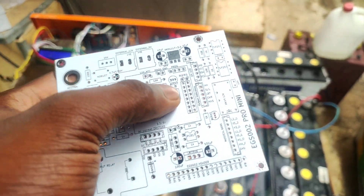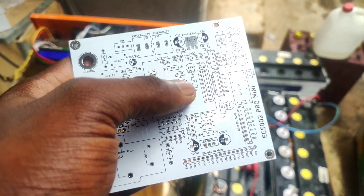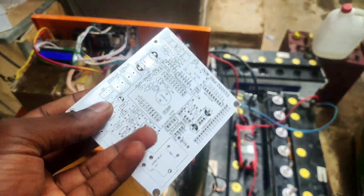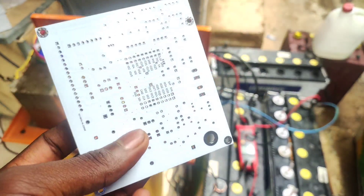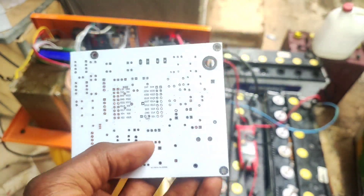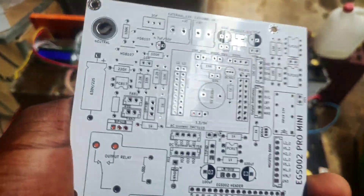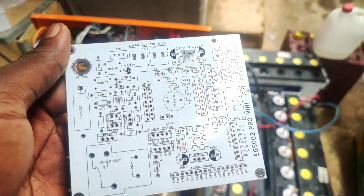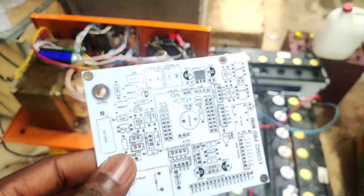As time goes on, we also plan on using Python code. Another part of our criteria for choosing this chip is that it's currently the cheapest in the market. We want this card to be very cheap — we don't want the cost to be so high that it gets pushed out of the competition. The known limitation of the ESP32 is its ADC, but we've been able to solve that by removing the filter array. So now the only challenge this design has is the changeover.